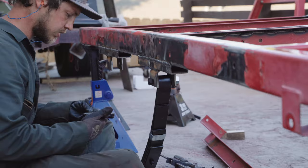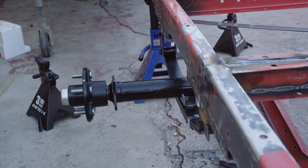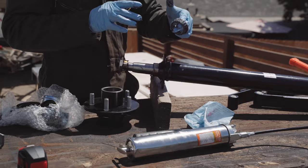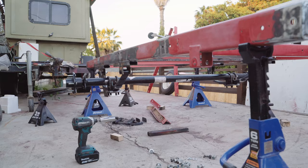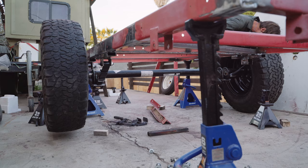I installed all the suspension and mocked it up, knowing it would be important for checking clearances with the wheels on as I continue the project. Before installing the axle, I had to put the hub on because I don't want weld spatter and grinder dust getting all over the spindles. It's bad to mix grease, so clean off all the grease that came on the spindles before packing the bearings and installing the hubs. If you don't know how to pack bearings, let me know in the comments so I can plan a how-to video. There's still a long way to go, but getting the wheels mounted to the frame already felt like a big accomplishment — I'm not a professional, so I learn as I go and every small accomplishment is a big one.